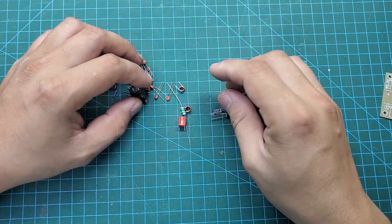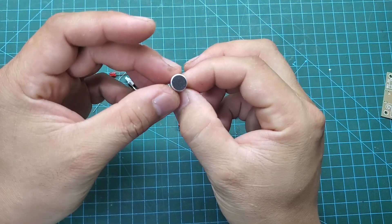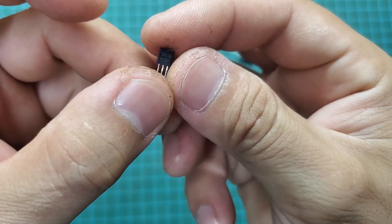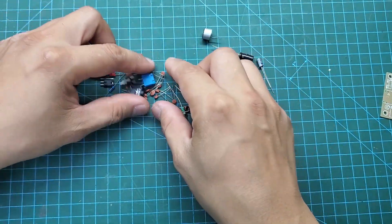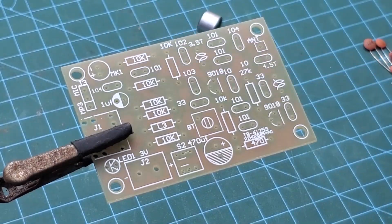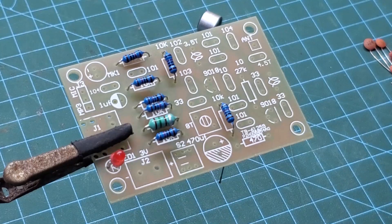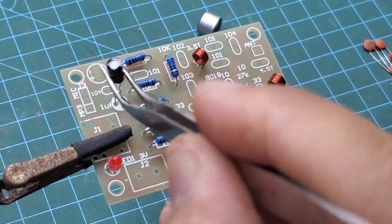Here are the necessary components to assemble this circuit. This FM transmitter circuit uses two C9018 transistors, which are very common and easy to find in old devices. One transistor amplifies the microphone signal while the other generates high frequency. Even if you don't use a microphone, one transistor is sufficient. Additionally, we will need a few resistors, capacitors, and an adjustable inductor. All the components have clearly marked values. A beginner in electronics can easily assemble this circuit. Even if you don't have components that match the design, it will still work well — just adjust the value of the inductor and the circuit will function as intended.